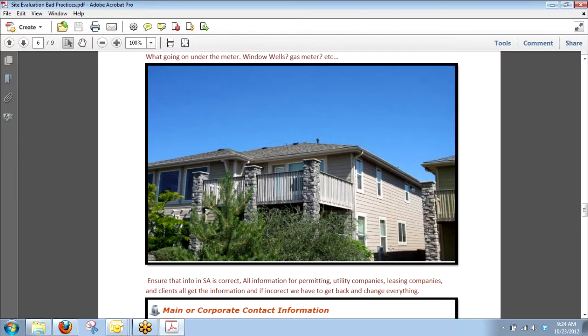I need pictures from top to ground, left to right, so I know what's going on. If the main distribution panel is on the corner of the house, get me both sides so I know where we can put things. If the MDP is right up against the other side which is the garage, maybe have them open the garage and take a picture — that might be the way to go. Maybe we can put it in the garage, especially if the service is on the south-facing wall, because you don't want to put your inverter out there where it'll be blasted by the sun all day — it's going to overheat.